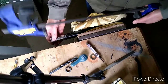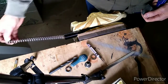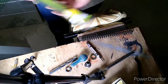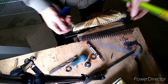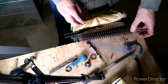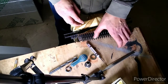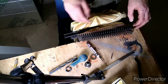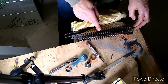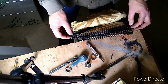Well, that's the least amount of spring pressure I've ever known — that might just be why the gun was a little underpowered. Spring guide — very nice. Spring. Now let's compare that to the new one, because I was very curious about this — the cylinder is so damn short. Count the number of coils: two, three, four, five... I make that 27, including the ends. And the new one: 31.